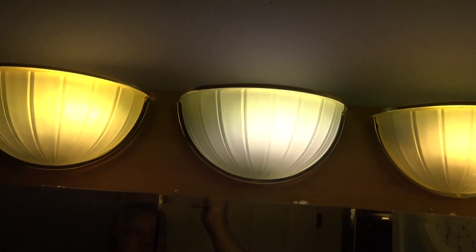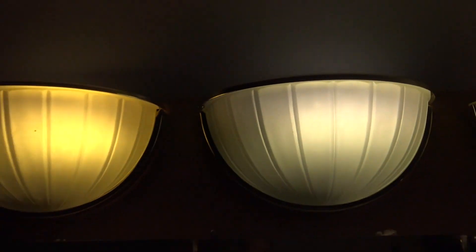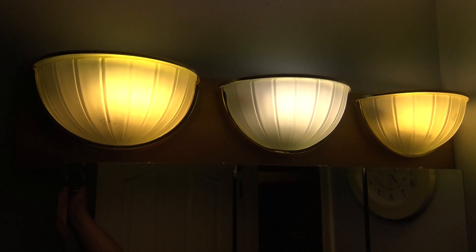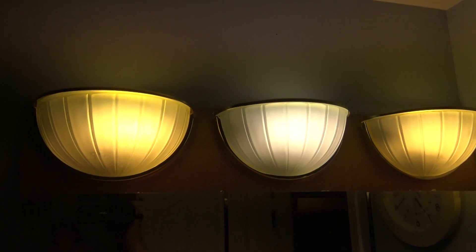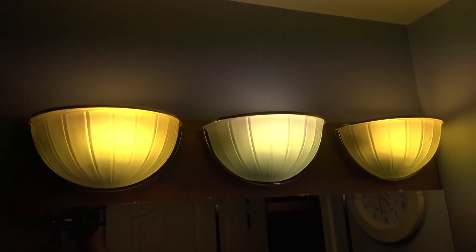And there you have it — the lights are a different color, I'll have to change them. My wife actually prefers the color of the one in the middle because the wall is painted blue and it looks blue under that light but not the others. I had three of the same color and one burned out, and when I bought a replacement this is what I got. When the others go I'll just replace them with this type. But there it is — a custom light fixture, something you don't normally find in stores. We recycled three perfectly good PL-type fluorescent fixtures with preheat start ballast and made something unique that looks a lot better than the old rusty one that came out of here. Thanks for watching and we'll catch you in the next one real soon.